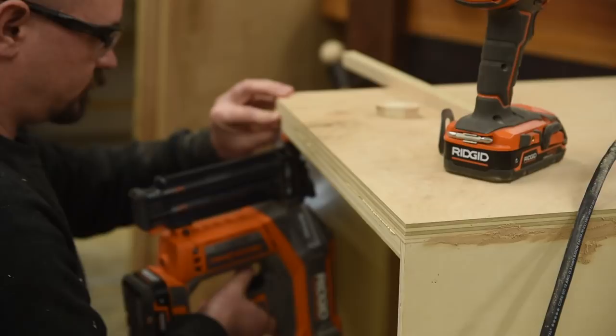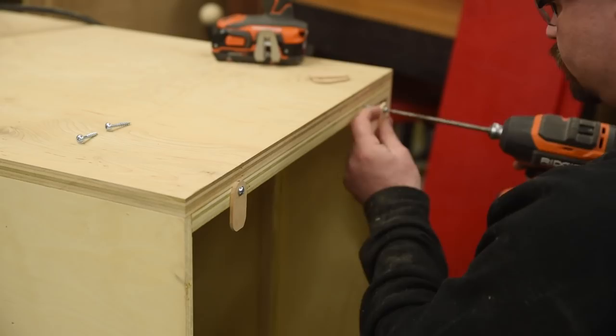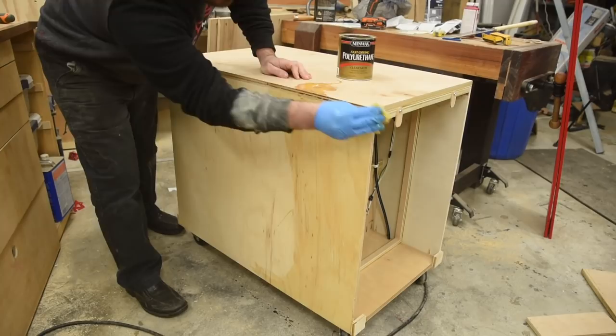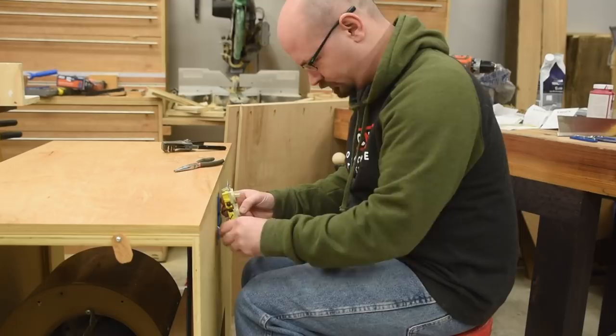The only trick is making sure that the hole in the tab is slightly larger than the diameter of the screw so that it'll swing freely around the screw. I give everything a coat of poly to make it look a bit nicer and give it some protection, and I really like the veneer on this top piece. This will probably annoy some people, but I'm not covering the details of how I wired this because I just followed the wiring diagram on the motor to set it to slow speed and the instructions that came with my switch outlet combination.